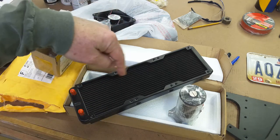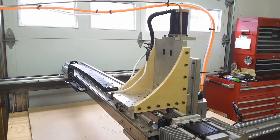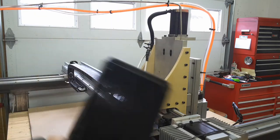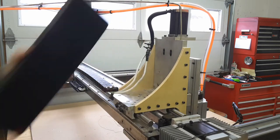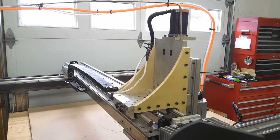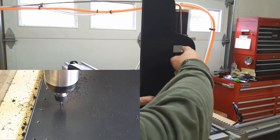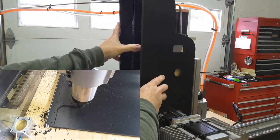There's a ton of space right here on the carriage, so I'm going to mount the radiator here, all those hoses go away, fans on it, and there'll be enough room for the reservoir and pump. I took the CAD drawing for the existing braces and modified it — now I have a pair of black ones. One side has a hole in it for the flow meter and temperature sensor, and the radiator will use angle brackets and mount between them.